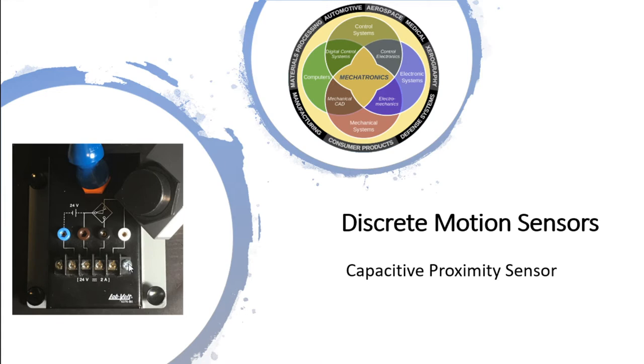One thing that you'll oftentimes notice with the capacitive sensors is that the capacitive sensor has a much wider face, and you need more face to detect, where the inductive sensor could be relatively small, but it's got the same distance. The bigger or wider capacitive sensor actually increases the ability to sense at farther distances. Okay, we'll see that here in a moment.